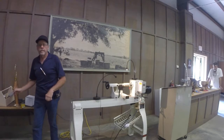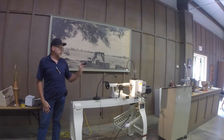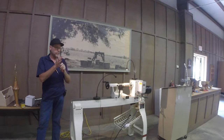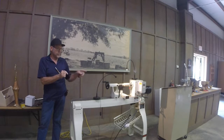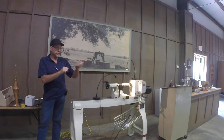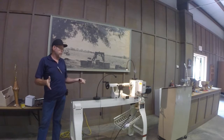And even I've used this. You've seen the two-part epoxy putties that you fix plumbing with? Yeah, I've used that. And this is metal, and it actually works. But the trick to this is, roll a little, like you roll modeling clay, put it in the groove, make your groove a little deeper than you normally would for CA. Press it in there, and I've got a little tiny roller, like a roller for rolling screens, and hold it at low speed and just roll that in and get all the voids out. Typically, you don't have to go back and do it.